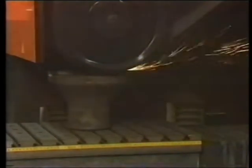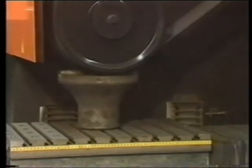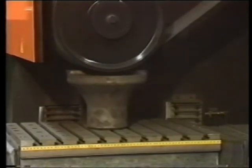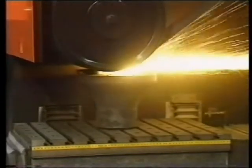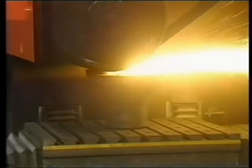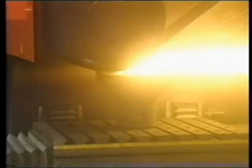The machine offers a 75 horsepower drive motor complete with soft starter and a reciprocating bed that is designed to take a combined fixture and casting weight of up to 200 pounds. With an 8-inch wide abrasive belt and belt oscillation, the RGS 875 is very efficient at removing large amounts of stock.